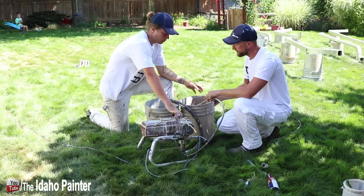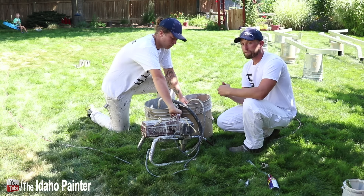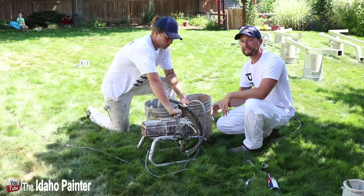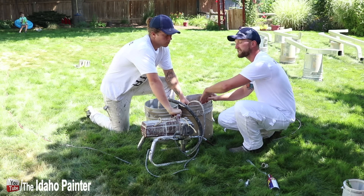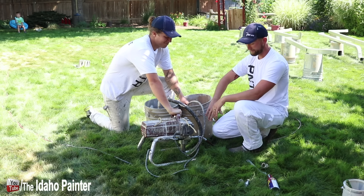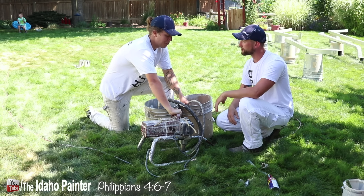We always want to hold on to that prime tube because occasionally in the middle of re-priming, it can build up some pressure — especially on a bigger pump. When you turn that down to prime, it'll release all of that pressure and kick up. That's how we can always tell we have a new guy, because they've got a nice stripe of dirty water or paint coming up their clothing.